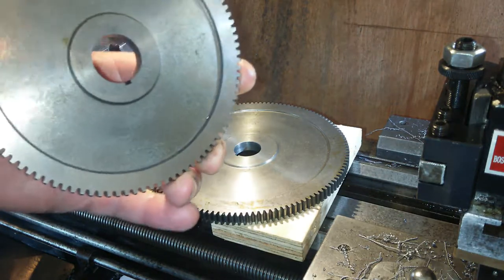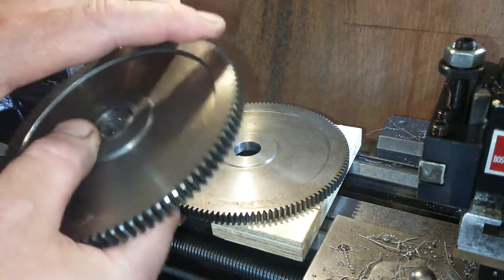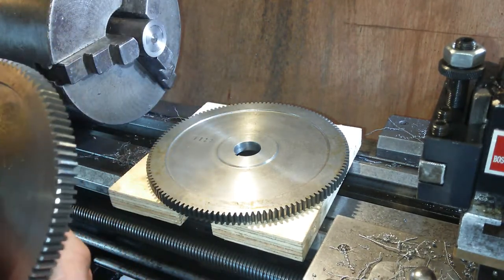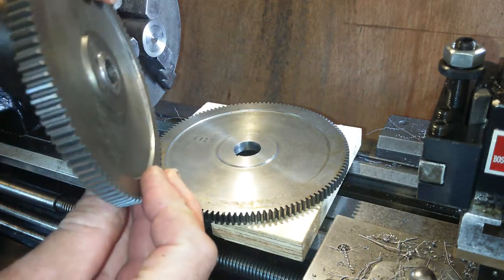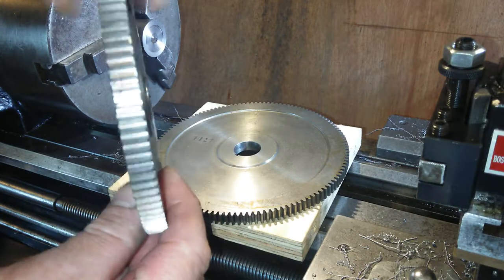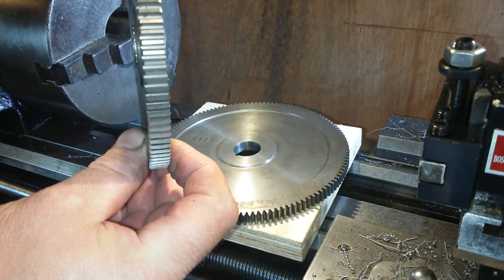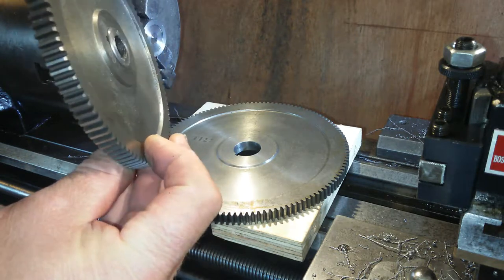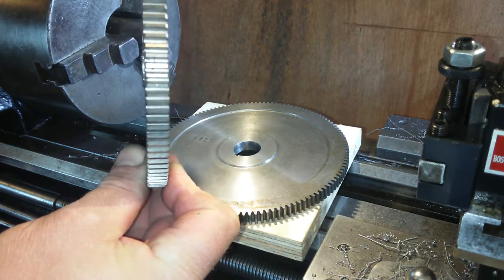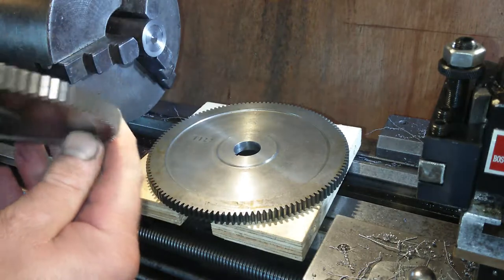It's a good tight fit, but the problem with this one is I overbored it slightly, so the collars fit in all the way. A bit more light on the subject, might be able to see it a bit better. So that's all the collars are doing, just making the gears centralise. So they're too thin, so they just sit too far in. So I'm just pulling them out a little bit so they're centralised. Doesn't have to be done, but should be good.